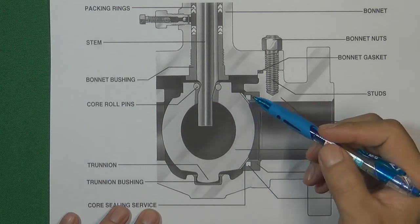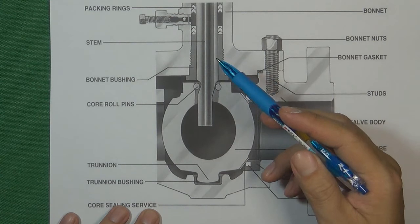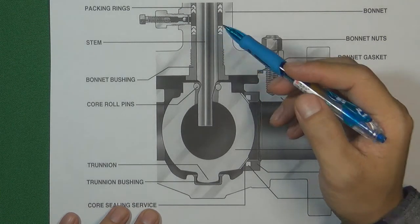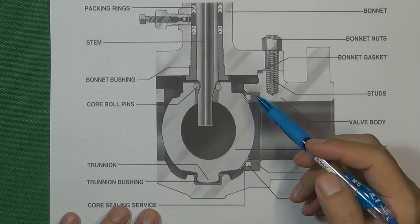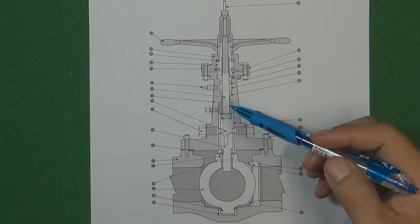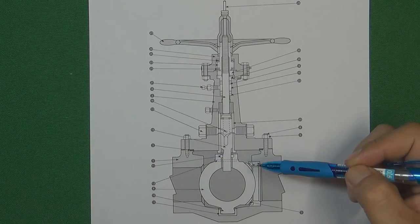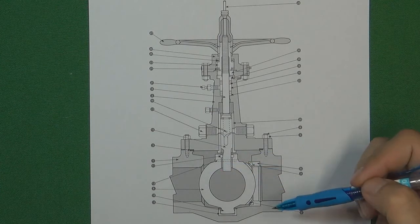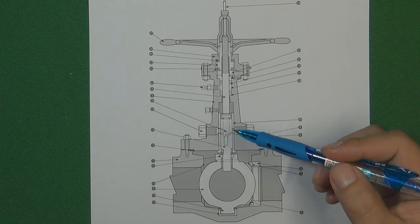When the ball has already left the valve seat and the top of the valve stem is located in that area, the valve stem turns, so the ball turns. That is the basic principle: the two steps of valve stem movement control the ball in two kinds of movement as well — one step causes the ball to leave the valve seat, and the next step causes the ball to turn. That is the basic principle of how the orbit ball valve stem controls the ball to have two kinds of movement: one is to swing the ball from each side to touch or leave the valve seat, and another is to turn the ball to open or close the valve.